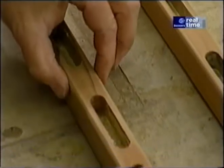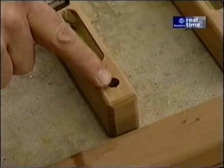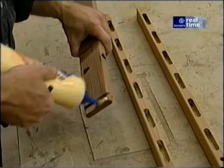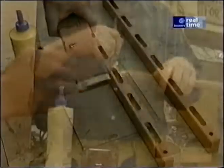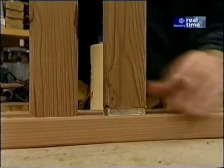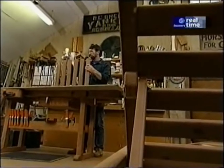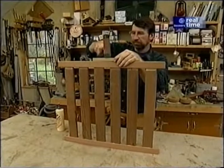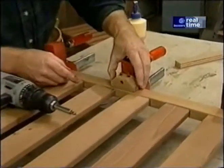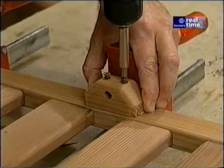The sides of the backrest are some one-inch wide pieces of redwood. I've mortised them for the slats just as I did earlier, and I've drilled a hole for the pivot point. I'm using some weatherproof glue to join the tenons and the mortises. The adjustment arms for the backrest pivot on these little blocks — they're located centered on the side pieces and they're attached with some glue and a few bronze screws.